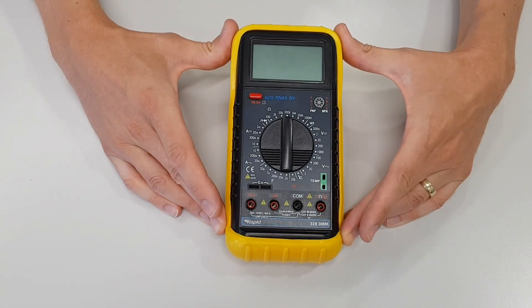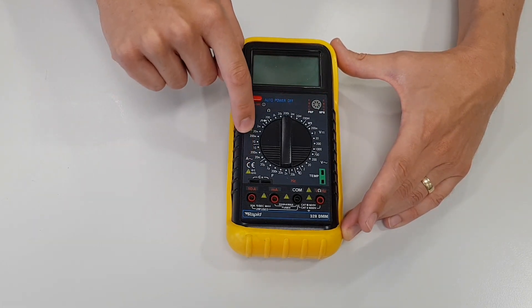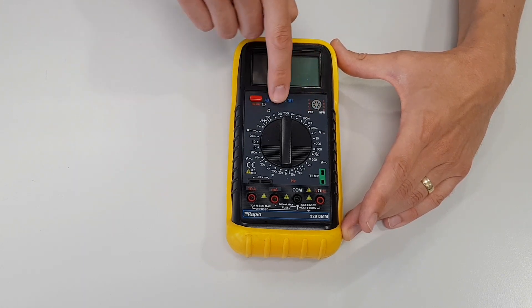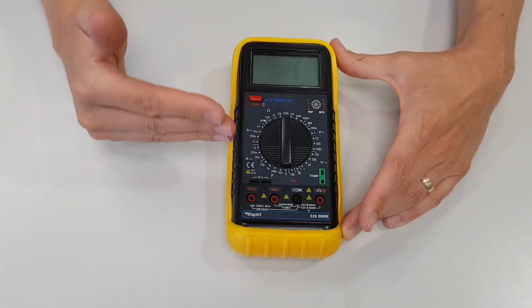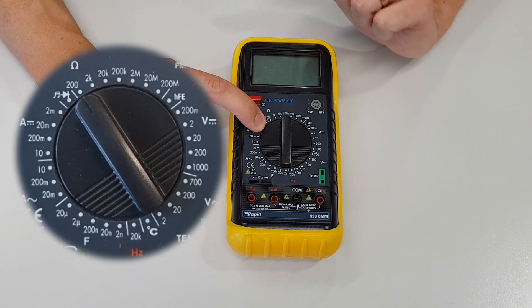On this multimeter today we're going to use it to measure resistance. You'll remember from our SI Units video that resistance is measured in ohms, so we need to turn this to the ohms setting. On the multimeter, if you look around the outside you've got various different settings. There are lots of different multimeters available, so you'll have to get familiar with your own. We're going to be working on the ohm range — you can see the little omega symbol there — and because we're working with fairly low resistance values, we'll turn the setting to the lowest resistance measuring setting, which is 200 ohms.